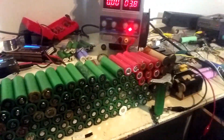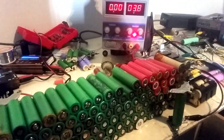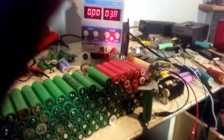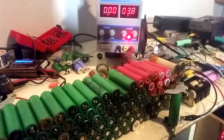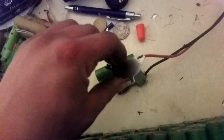So what I'm going to do is go through and find all the cells that are charged — all the best ones first — charge them up to 4.2V and sit them in a pile. After they've been charged like that for a little while, check the voltages. If the voltage is still above 3.9V or around 3.9V, they will go onto the discharger.